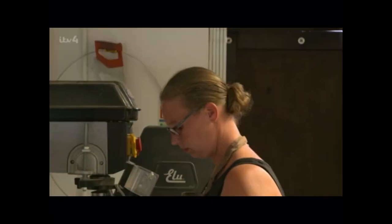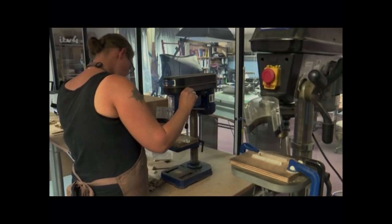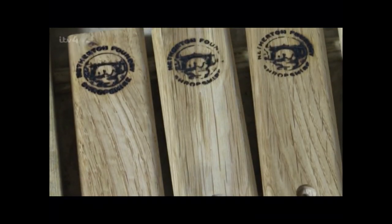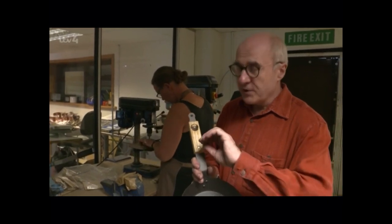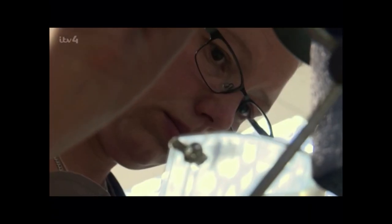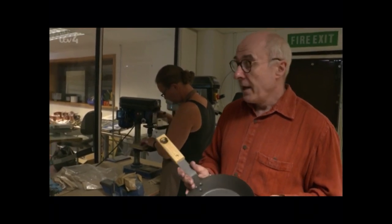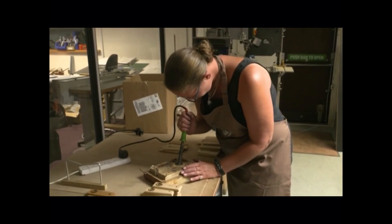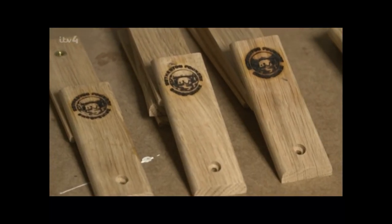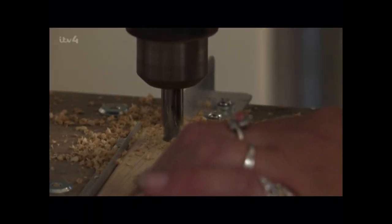The pan isn't finished until a set of oak handle covers are put on. These are British oak. In one shot, we put in the small hole that goes right the way through, and this wider one that's going to hold the screw in place. Handles are designed to come off very easily, so when it comes to seasoning your pan, with a couple of twists of a screwdriver you can take the oak handles off, re-oil them, put them into the oven, and it comes out like new. A lot of our oak is grown locally in the wild forest, about five miles from here. The logo is hand-branded — everyone's slightly different, and we like that. Mandy then drills the second hole for the brass insert, which holds the two halves of the handles together.